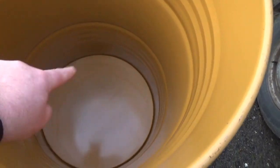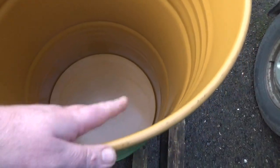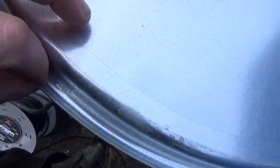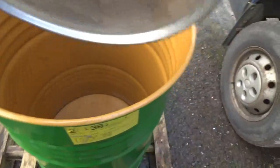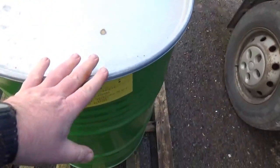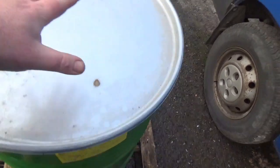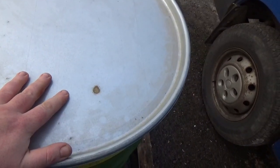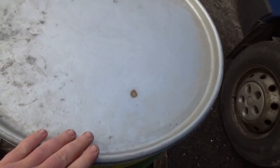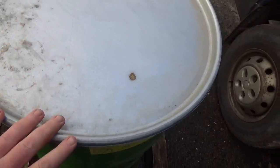So instead I'm going to take the bottom out. The barrel will go on this way up, then we'll put the lid on with a little strip of stove gasket down in there — fairly minimal gasket. Then we'll put the band clamp on and that'll snug it all down nice and sealed. That means when it comes to maintenance every year, all I've got to do is undo the band clamp, flip the lid off really easily, give it all a vacuum out, and I'm done with the riser section — much, much quicker.